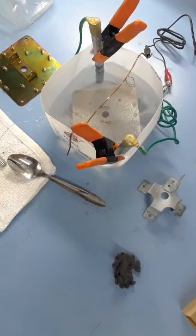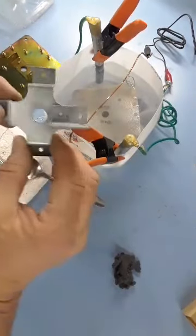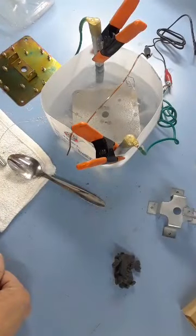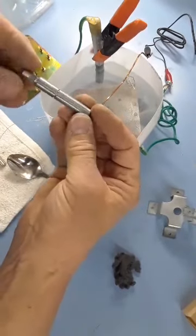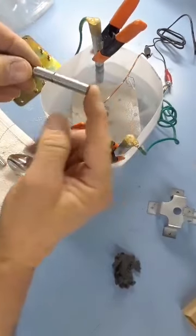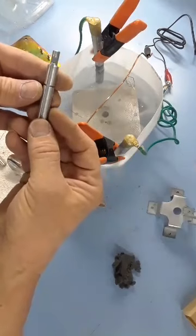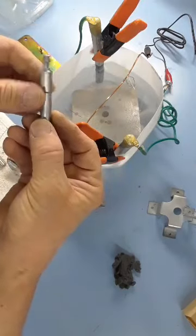I'm using zinc, and these are standard cold-rolled steel plate parts that have been molded. The shafts are Ledloy — I think they're 12L14. I got the basic stock in and then had to cut the ends, put the groove, and mill the little indent at the top for the set screw.